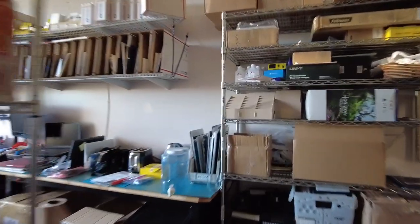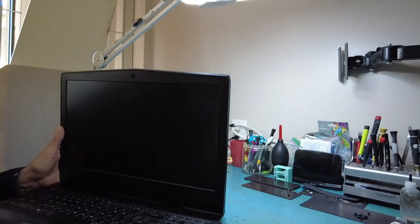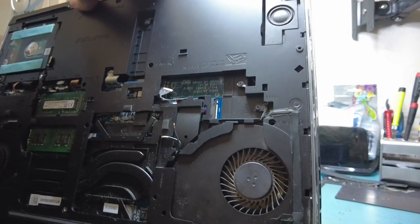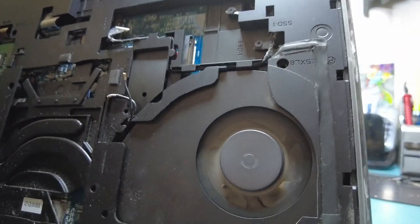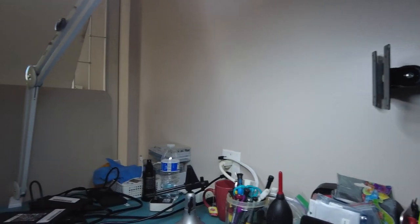Big Boss is done with the reassembly of the Dell Alienware. Let's see if my final prediction is correct. We do see the flashing power button. Most likely the computer is going to power on, then off — on and off — and that's an indication of a CPU problem. Fan is spinning — then off, then on, then off. That's it. CPU problem. And I predicted correctly.